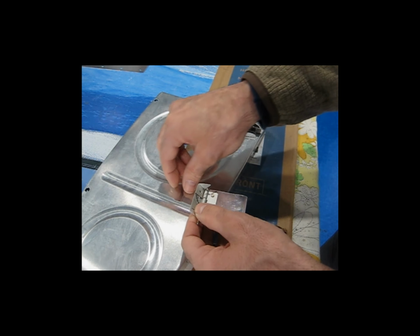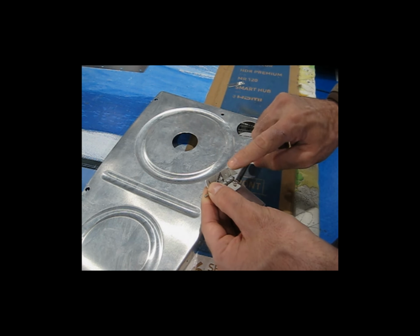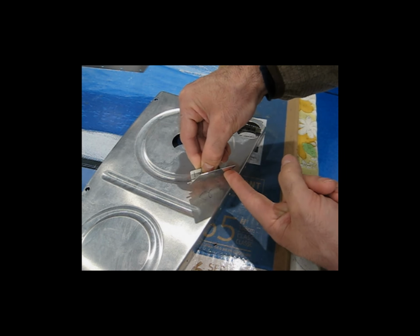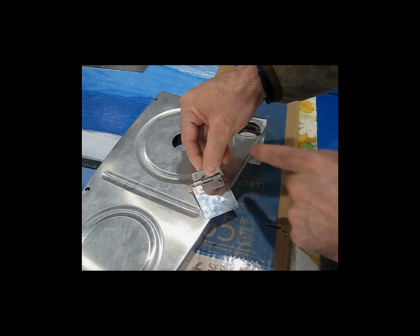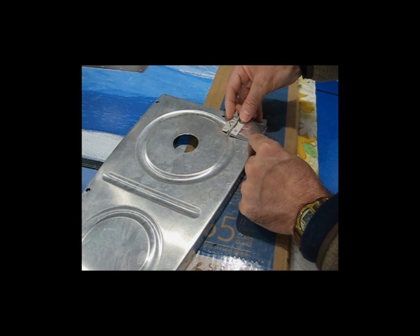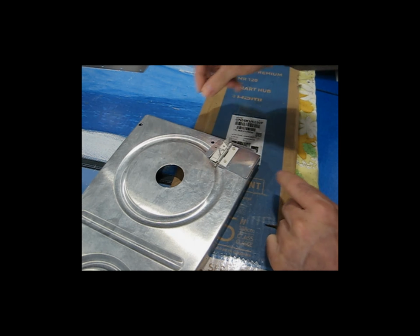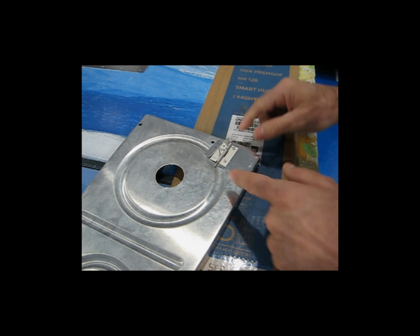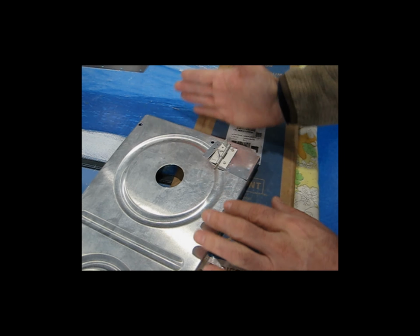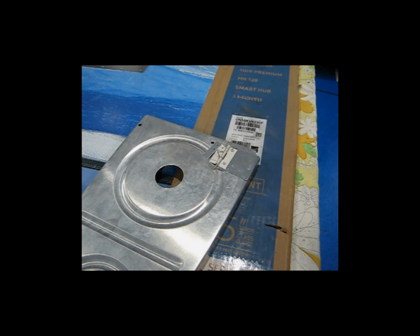And that's it. And then the hinge itself is made directly from the plans. This size of the door is made to plans, and I put this little kick here. That way the door has a stop. It has a stop here. It can't come all the way up and then stay there and not cover up the hole. So that's my door. So I'll fit this on, I'll locate it where I want it to be. And then I'll go ahead and drill these holes, make sure I get my shim in there and rivet it. Done. The last thing that I'll do then is pull this pin out and put a bend in it. Put the pin back in, and then when you put your baffle on, the hinge pin is trapped. That's that. That's the little flapper door.